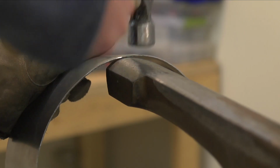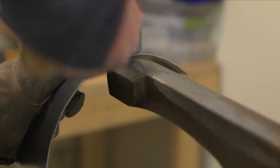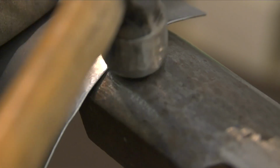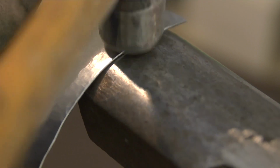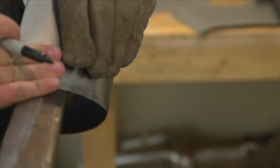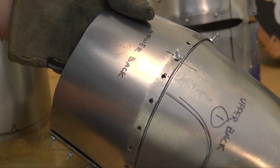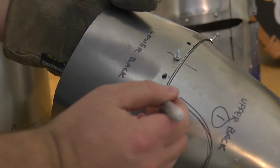Basically, you don't want to cut out the eye openings, and you don't want to cut the breaths in the mask until you're completely done with shaping the metal and you're satisfied with the extent to which you're going to be planishing, if at all. But if you do want to bring it to a high polish, you don't want any dents in there, you need to complete all of that before you cut out anything. So this would include the openings for the eyes, this would include the breaths, and really this would also include the holes for the rivets. You really need the pieces to all fit together before you cut out any of those pieces.